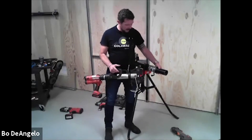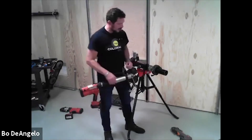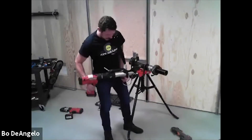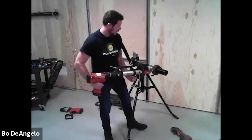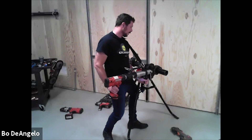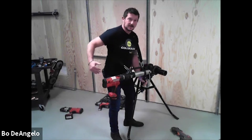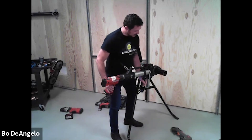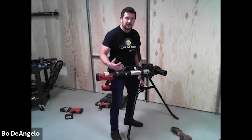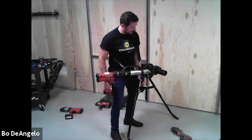I've prepped this already, so I'm going to go ahead and make the press. The ring goes over the fitting hub — make sure it's locked securely in place. This is a double press process, and the tool can be a little heavy so I recommend using the strap. I'll lock it onto the ring and squeeze the trigger. Now I'm stuck — I've only completed part of the press. I still have swivel ability, but I need to squeeze the trigger a second time.